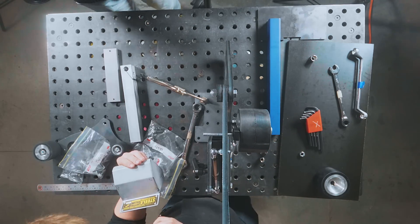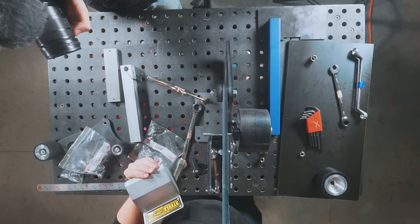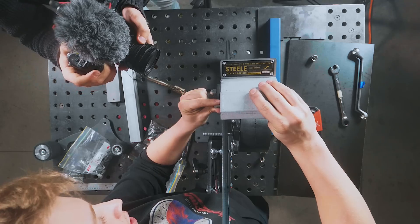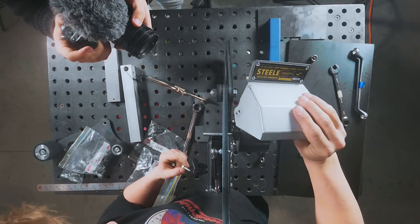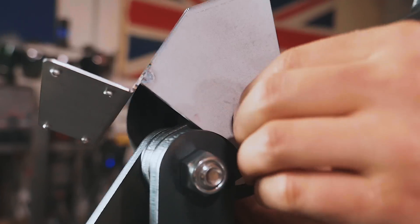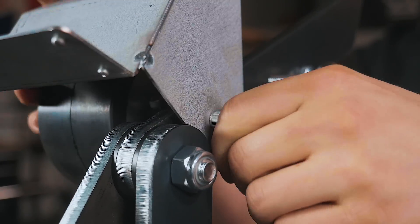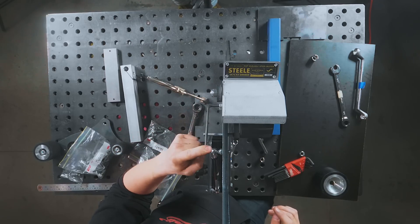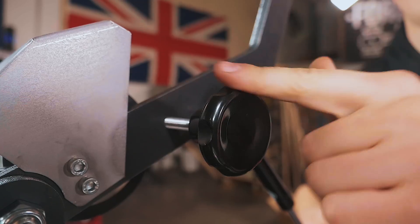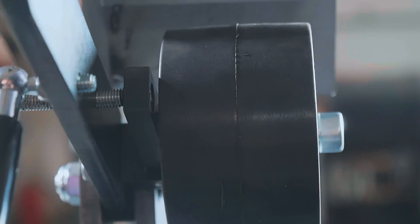Go ahead and take the spark guard, which has the machine tag on it — it lets you know what you've got: a steel 2x72 kit grinder. Take these two small allen head screws and get them started through there. There are two holes in the tensioning arm and two holes in the spark guard. Bring the tensioning wheel back and line up the two threaded holes in it, then take a 3/16-inch allen wrench and snug those down. Take this polymer knob and tighten it on — this knob adjusts the tracking wheel side to side, controlling where the belt sits on the platen.